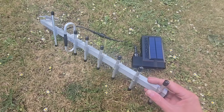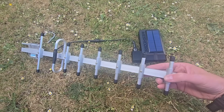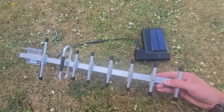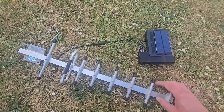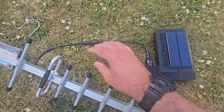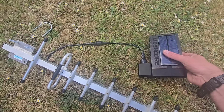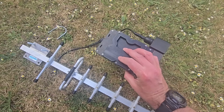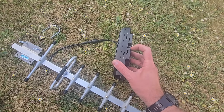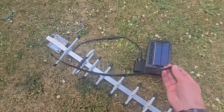I've got the antenna connected - this one is a powered AR 12.5 dB Yagi. I swear by these; if you're having trouble connecting to a distant repeater, these just work so well. I've gone around the connections with self-amalgamating tape to stop water getting in - standard practice for this sort of antenna work. The repeater now has the bracket on the back for the pole mount.